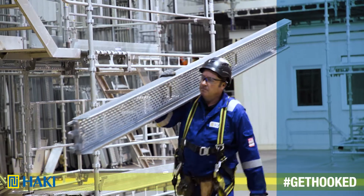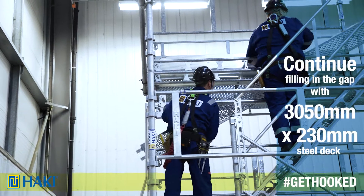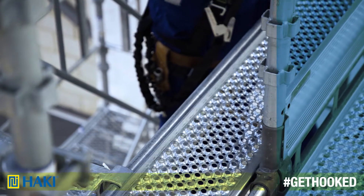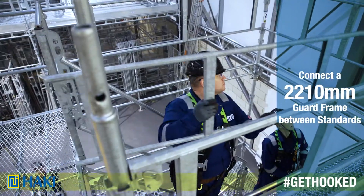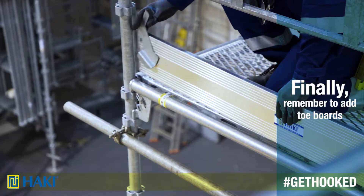Now, we'll need to fill in the gap between the stair tower and the scaffold. We can do this with a 305 by 230 steel deck. To complete the stair tower, we need to allow for a side exit. This has been done using a punching unit and a one-meter standard. Connected into them, we use a 2210 guard frame and finally, we toeboard it.